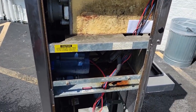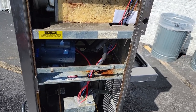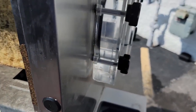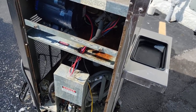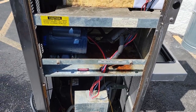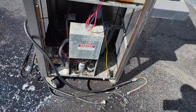If thin water does not leak out the front, then the mix should not leak out the front. What I think happened was they put the white bushing that's on the front onto the back. Because it has a nub on the front it would have still set in there and rotated without any major noise. When they were showing me how they put it together they said it goes on the back - I said no, then they said oh yeah, I put it on the front. I think that's what actually happened. The problem is training - they really need a video, and I've offered to make one.